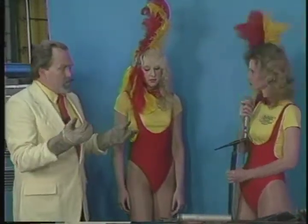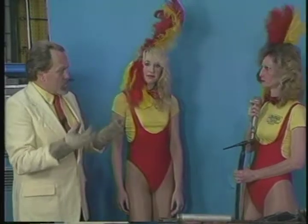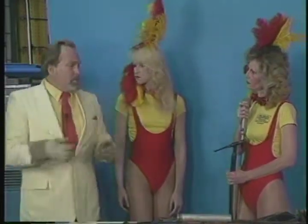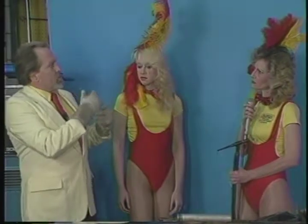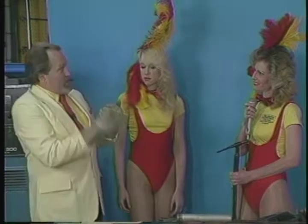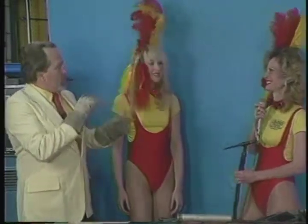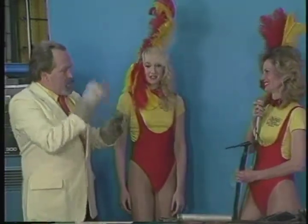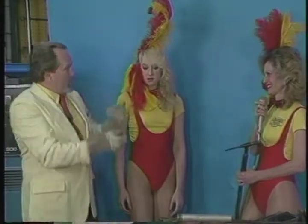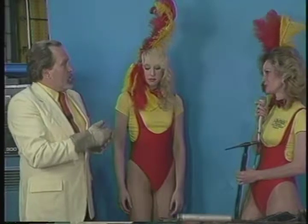No, we're not just talking about the physical appearance, we're also talking about its strength. All right, so this machine has the ability to alter the electrical cycle to have more electrons flowing up than flow down. Is that right? Yeah, in a normal 60 cycle thing, the electrons go back and forth, equally spaced and all that. Well, with this you can have a longer time coming up than going down. And how do you know how you want that to be?